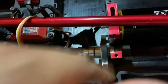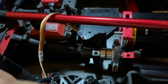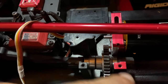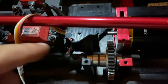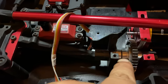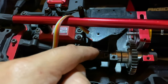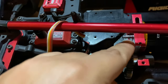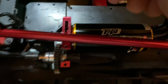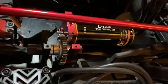Check for no shaking and no jamming in the bearing — try pushing it front and back; it should sit in place and not move. If you find it has play, add washers or make adjustments to keep it in the right place. Don't over-tighten and don't add more washers than your two mounts allow. Here is the motor — a 4070 can actually fit here easily.